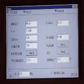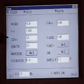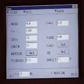The thickness of metal: you won't have to, at this point, measure the thickness of the metal with calipers if you know the given gauge and what the given gauge should be. As long as the metal is not too far off, the computer will get you where it's supposed to be. You can make your first bend, and at that point we will make a correction on the correct angle to compensate for the thickness and/or tensile strength.